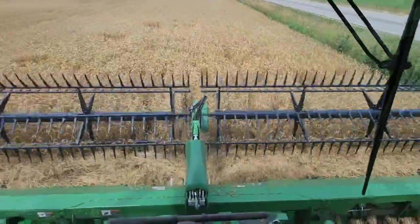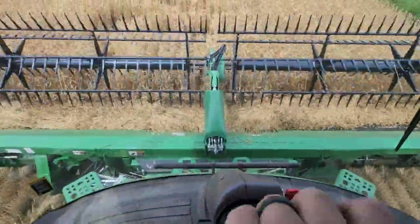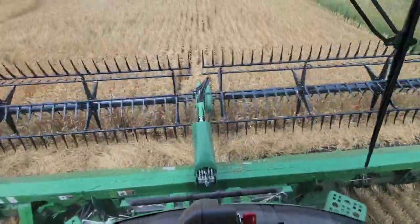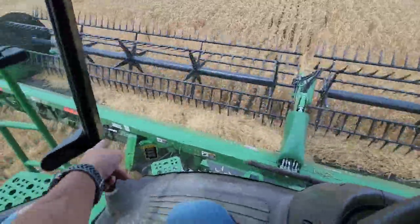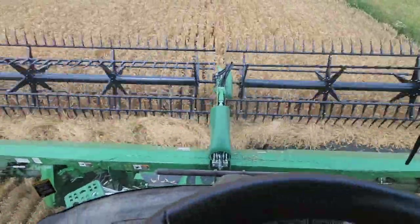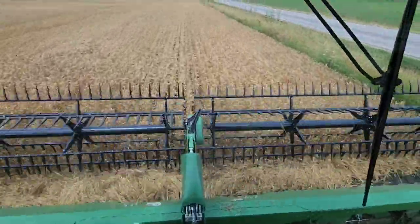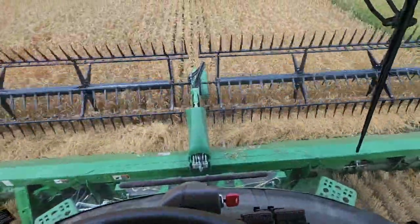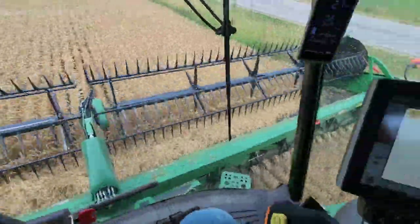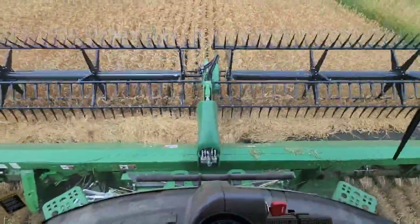We were hooked up getting some end rows done here. I should have filmed it but I didn't. My center draper belt — the one that feeds into the feeder house — every time I hook the head up and start it for the first time it doesn't want to go. Sometimes when you let the head down it starts going; this time it took forever. I switched speeds on the gearbox, went from high to low to see if that would make it go. It eventually did and I don't know why. I know one of the engineers from John Deere who helped design the center feed section of this head is watching my videos — so if you're still watching, tell me what I'm doing wrong. Draper speed adjust problem, but my belts are moving. I don't understand. Something's not right.